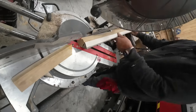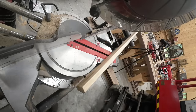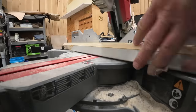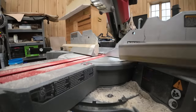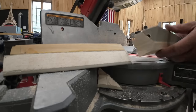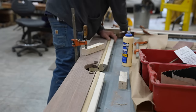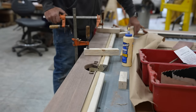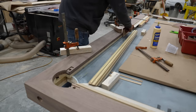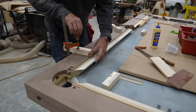In some cases you'll see me using a spacer — I had a spacer available to make sure the corner pockets were a certain width and the side pockets were a certain width. You can see how close it is when I cut it — what I have left over is virtually useless. So it's really important that I make every one of my cuts extremely accurate, double-checking my measurements to make sure the distance between each pocket gives me the right distance on each rail part.